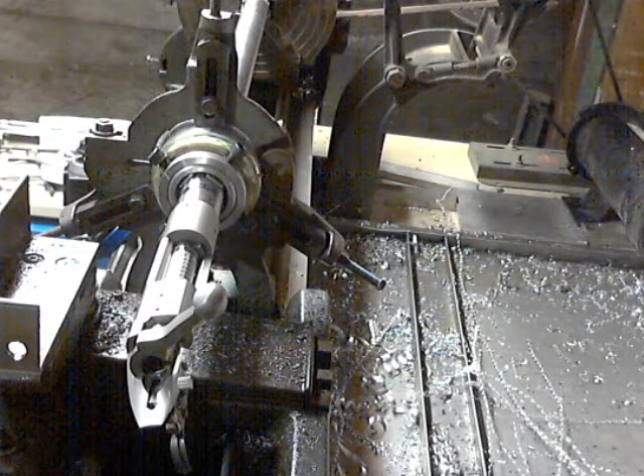I worked in a couple of machine shops. The first one, I went there 18 years ago. Every side was machined — all six sides were machined and all twelve corners were chamfered. Then it went off to heat treat, surface grinding, jig bore, or EDM. That was fine for that industry.